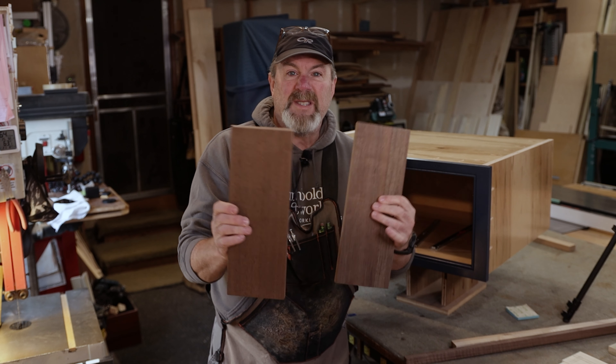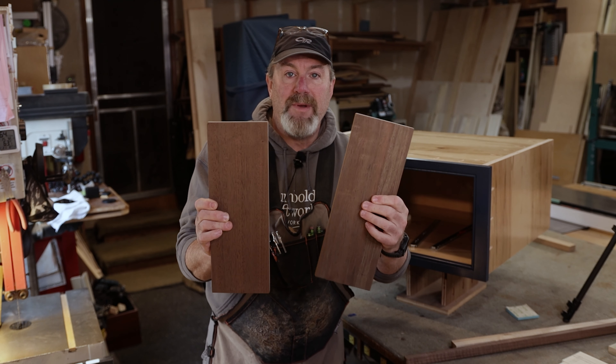The first thing I'm gonna do is try to figure out what size looks the best. I think I'm gonna use three-eighths by three-eighths little rails. There's always the right size — like the Goldilocks thing — so you try three different sizes and see which one looks the best. You do that before you start cutting all the dados because whatever I cut on here, I cut on the rails also.